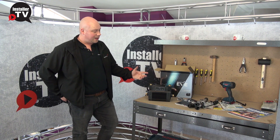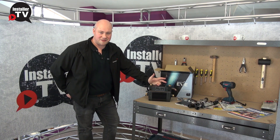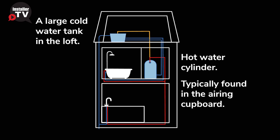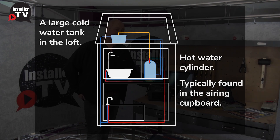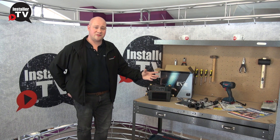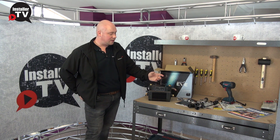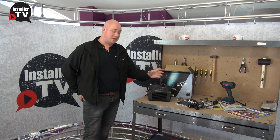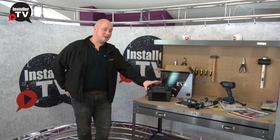One of the points I personally really like about EVE is the fact that it is a truly universal pump. If you've got a cold water tank and a hot water cylinder, EVE will work. One of the hardest points about specifying a pump is whether you need a negative head pump or a positive head pump — it doesn't matter with EVE. It's truly universal, and we don't have a pressure vessel on the pump. That's been built in quite cleverly with the electronics. Not having a pressure vessel removes any need for maintenance and also reduces the physical size of the pump, with everything now incorporated within the electronics.